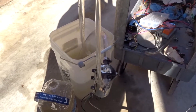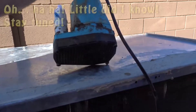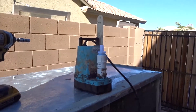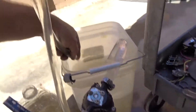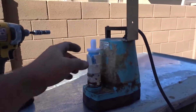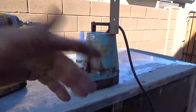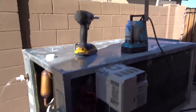Now I'm going to switch pumps. This other pump — I don't even know if it's going to pump water. It kicked on when I turned it on, but there was probably a reason it was sitting replaced. I took the top off and spun the impeller and got it to spin. I'm hoping that delivers some more gallons per minute. Shurflo pumps, depending on what they're for, they usually can do a little bit of pressure. These kind of pumps can do pressure but the volume isn't a whole lot. These other kind of pumps do quite a bit of volume — they're rated for three-quarter inch but they're not known for pressure. I'm just using what I have. None of these pumps are going to be installed if I actually ever use this machine as a water heater.